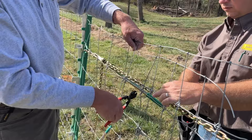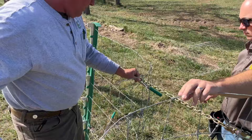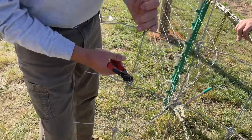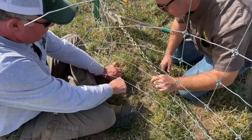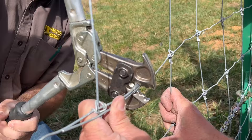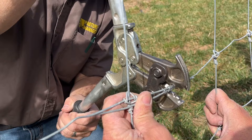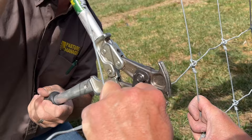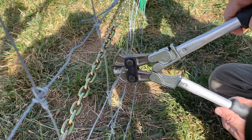Now that the fence is under proper tension, we're going to prepare the wire for joining with crimp sleeves. What we're doing next is removing the excess wire. We're now inserting each end of the wire into the crimping sleeve — it's joining the two pieces of wire together. When you're ready to crimp, crimp. We're going to crimp all of them three times so it doesn't slip. Try to slide your tool out to the edge so you're crimping all of it. If you space your tool perfectly, three crimps makes that sleeve flat. Crimp in the center, then come in and crimp all the way so the sleeve holds its maximum capacity.